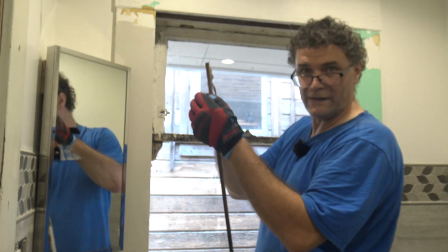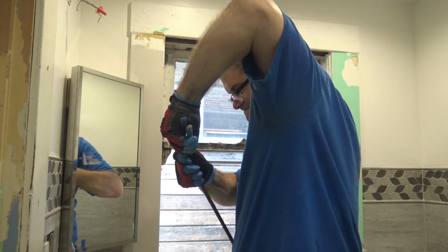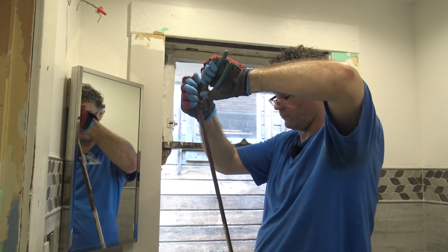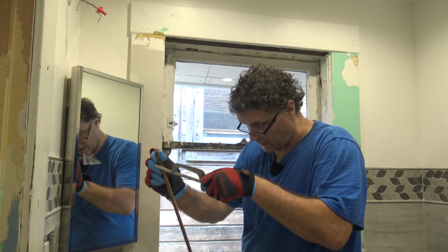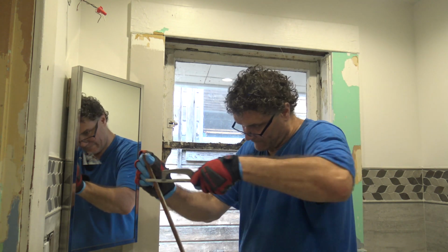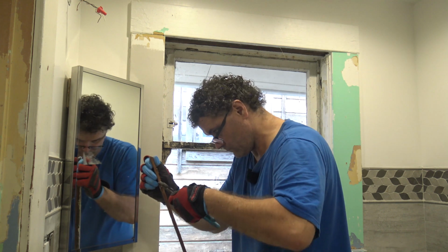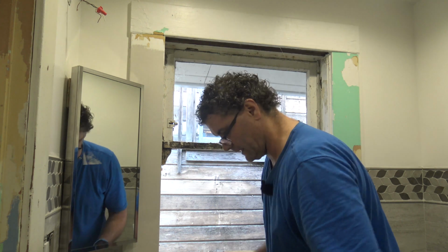Usually we'll see about 3 nails in it. Again, I want to try to pull this through. This wood is so thin, it's hard to do this without breaking, and the wood's old and dry. And this is a nail that's not going to pull out, so we just very gently take our hacksaw and cut it right off. Again, we should label this.